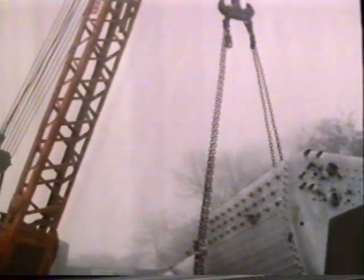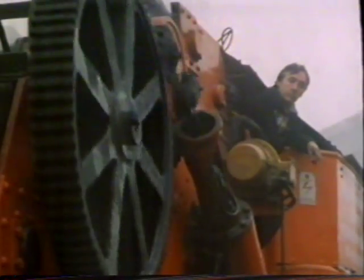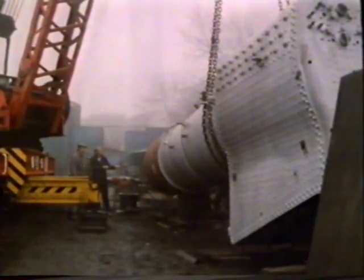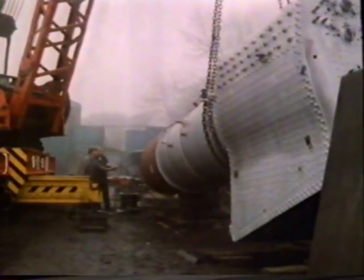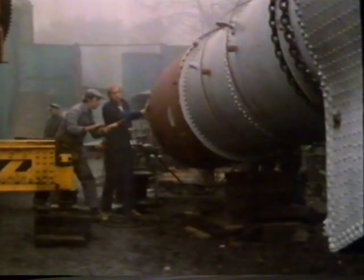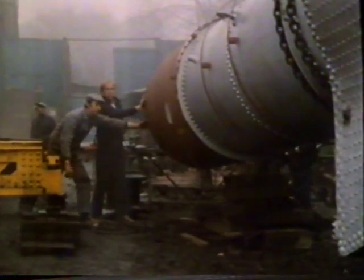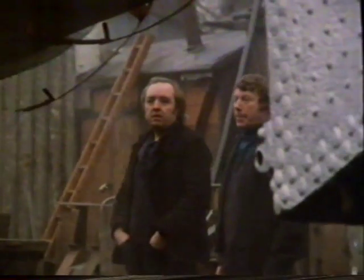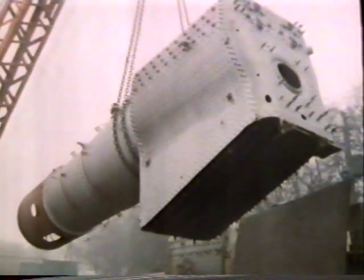Its driver Eric Riley swung it carefully round to hook up 80080's boiler. Up steady on the block, then. How heavy is this boiler? About 15 tonnes at the moment, Simon. So I'm just guiding it in with this rope. That's right. I suppose the critical thing is to have it balanced? That's right — we've got to get it dead right so that it comes down level onto the frames of the loco. Brel and I gently guided the boiler up until it was high enough to swing round.